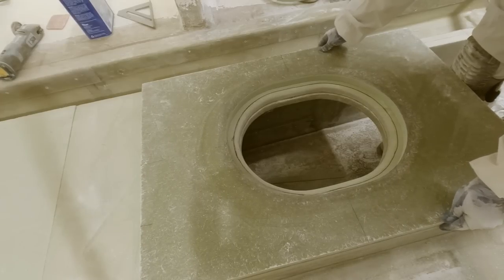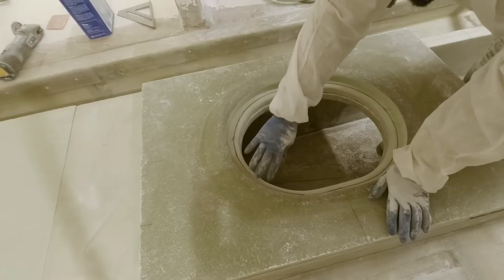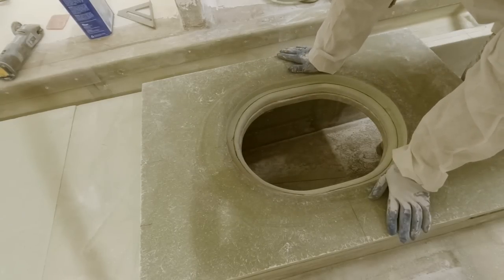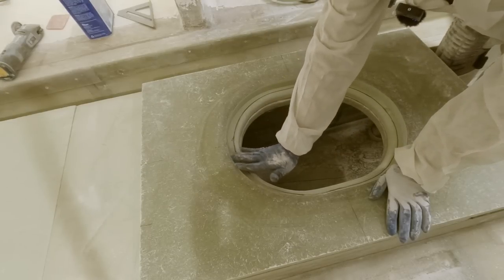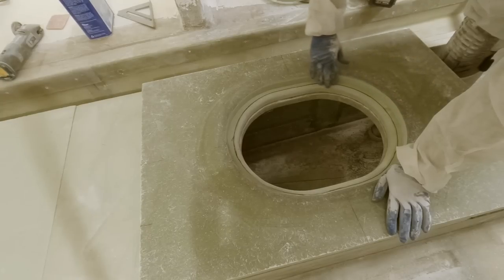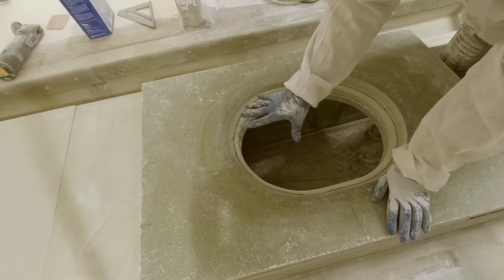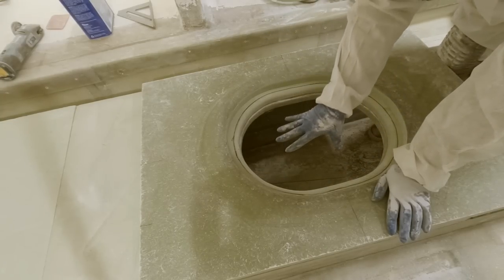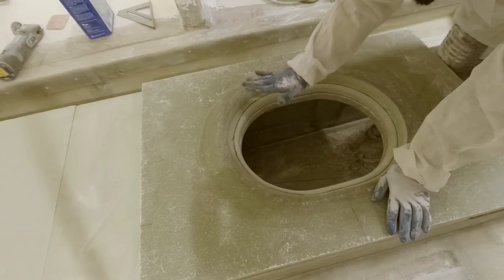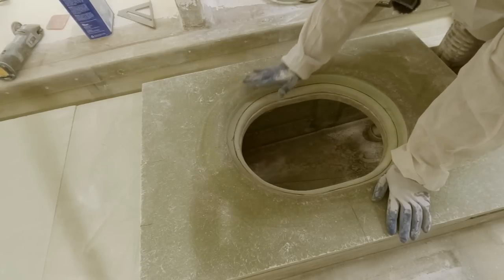When we go to actually make the gasket for this, we'll just use regular old silicone, and the surfaces will be all finished and everything. And what we'll do is use some Vaseline or some light grease on one surface, probably this surface down here, and cover it with grease or Vaseline. And then the hatch itself will get a really big heavy bead of silicone on it, and we'll just drop it into place. And we'll just suck it down a little bit, just to where the hatch is a little bit proud of where we want it up here.